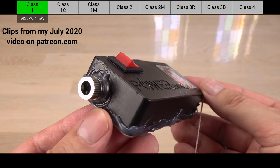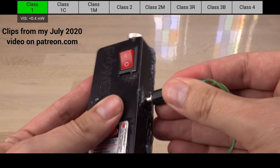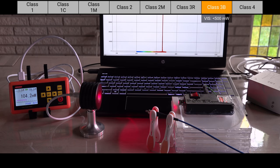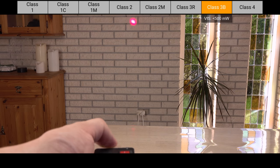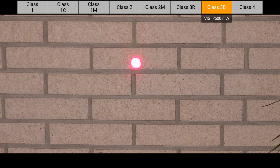An example is this laser built by one of my kind viewers, Peter Soft. Its laser diode was taken from a DVD burner, a class 1 laser product. Now, at the same power output, it is a class 3B laser since the laser beam is no longer enclosed and can hit me. Thanks, Peter, for giving me something to demonstrate a change in laser class from the same laser diode. Link to his video on the build in the description.